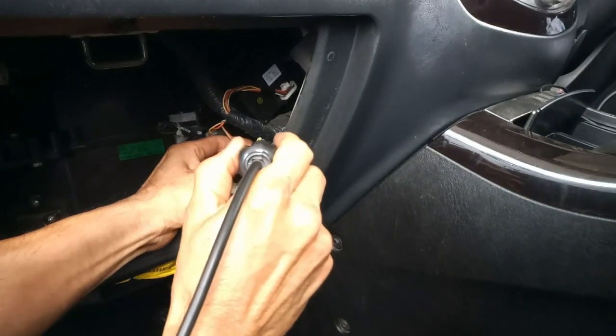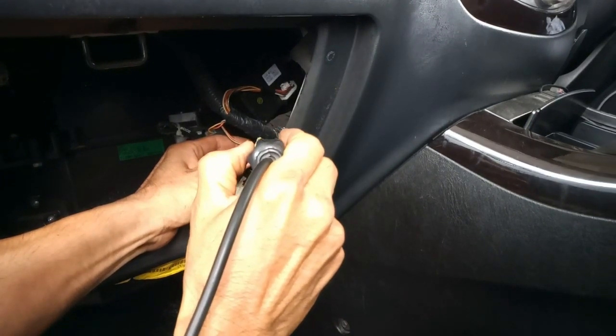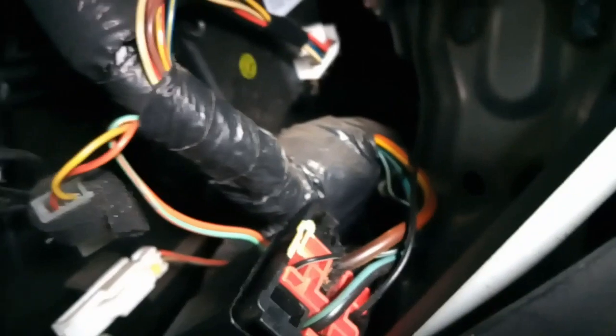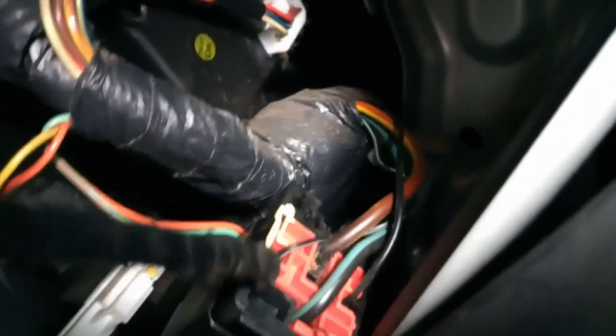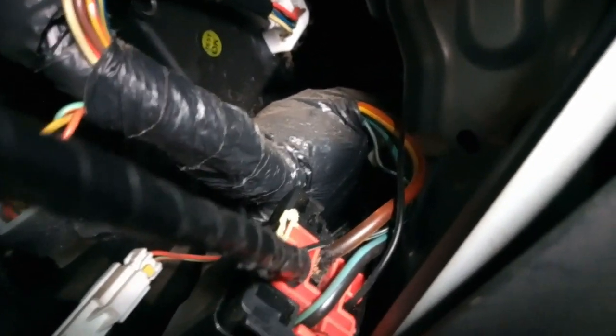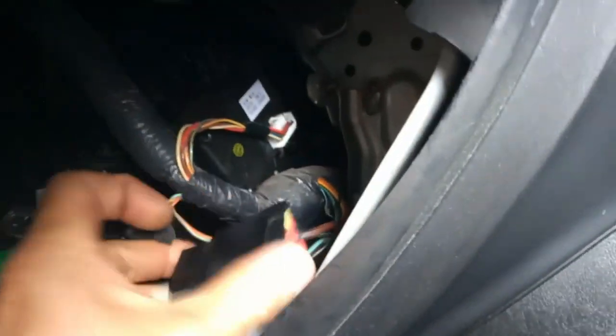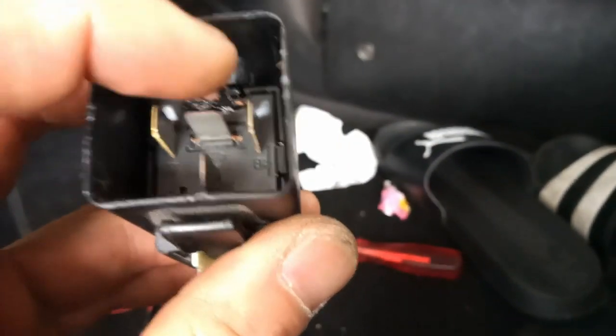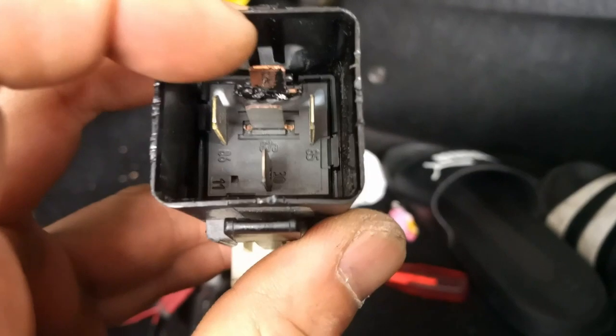No output power out of this big cable. I don't stop here — and I'm not sure how well you can see, but there's a brown burn mark here. I'll look at this relay now and see what's going on.